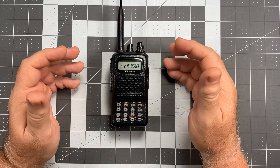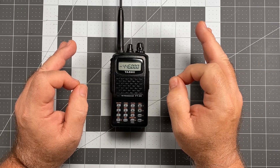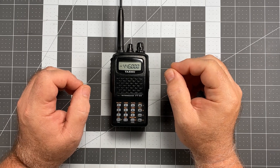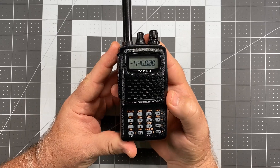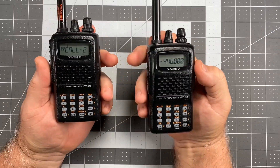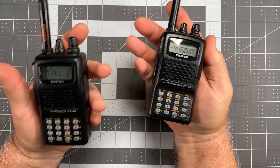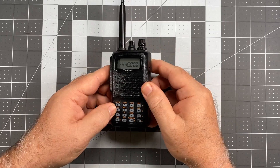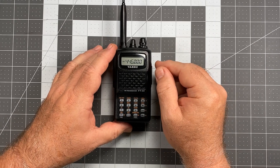For instance, if we wanted to go to the North American UHF 70-centimeter simplex calling frequency — 446.000, which is set aside for nationwide simplex operations — I have it right here. On this radio it's labeled Call 2, but it's the same frequency. Right now the radio is set up correctly, so if I key down everything works fine and I have simplex communications. That is because Automatic Repeater Shift on this radio has been turned off. But let me turn it on and show you the problem.